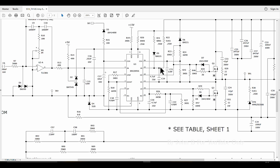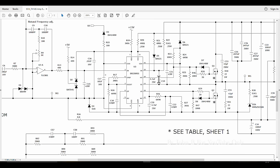Or you should have just been able to change the chip, change the FETs, job done 2 weeks ago. But no, I've got fakes. And it's taken me a good 16 hours solid work testing all the components. How do you know if one of these capacitors isn't shorting the signal out or pulling something down? I did loads of voltage tests and they all looked okay, but this chip was dead. So I stuck another one in, still dead.